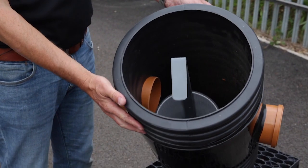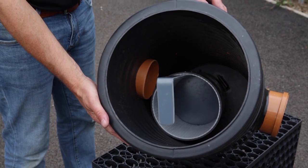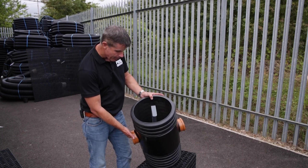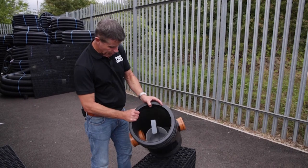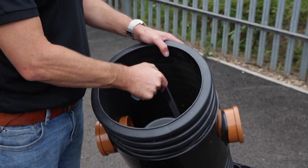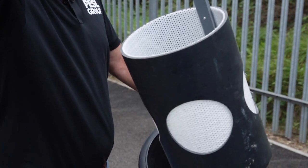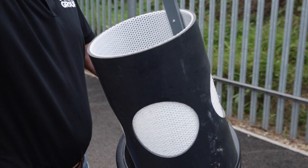Your water flows either from your rainwater pipe from your roof, or from your channel drain or land drain, or whatever you're collecting to send into your soakaway. The water flows through that inlet pipe, it falls down into the silt trap. If you look inside you'll see that there's a bucket with a very fine mesh that allows water to flow through and out the outlet, but it will catch all those horrible silt particles.